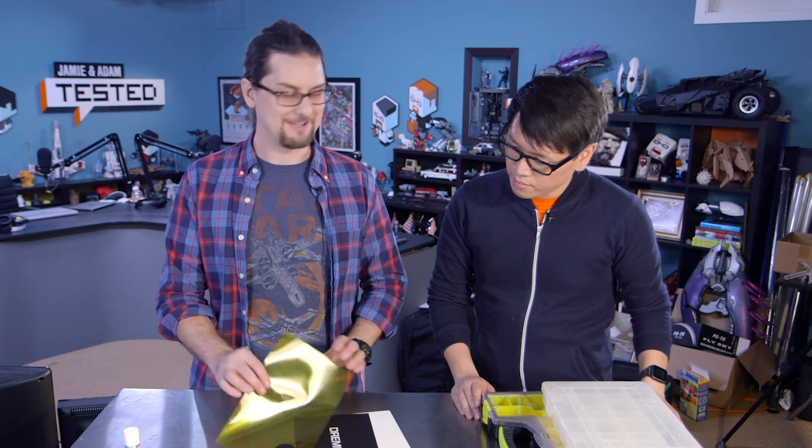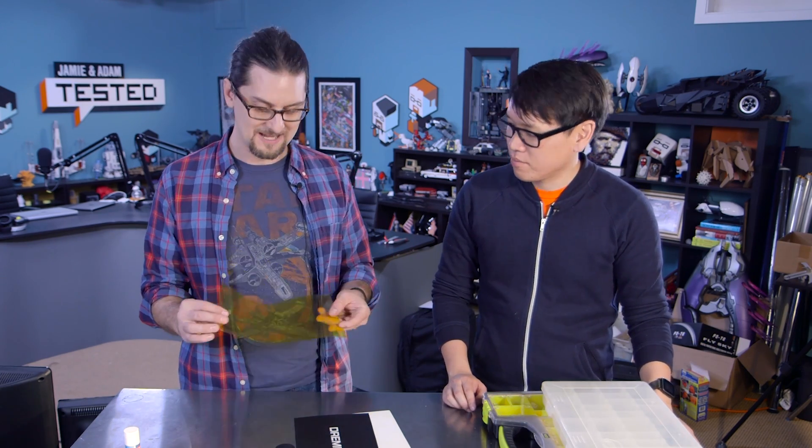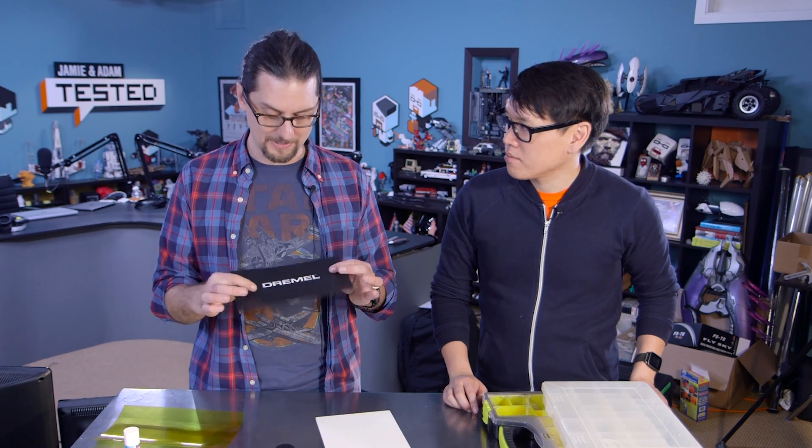The typical solution — and what they send with the Ultimaker and other printers — is a regular office supply glue stick. That worked okay for smaller stuff but didn't really fit the bill for larger prints. Hairspray is another big popular one and worked much better, but I was still having issues with the bigger stuff. Kapton tape is expensive and finicky to apply without getting bubbles in it — though it gives you a great surface.